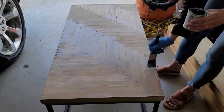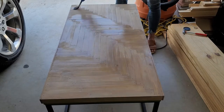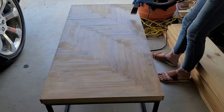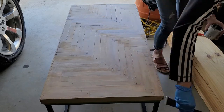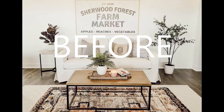With all my staining done, totally dry and ready to go, I clean the surface and then I'm using a matte polyurethane to seal it. This is a coffee table so it'll get harder use. I like how the polyurethane is shiny so I can really see where I've hit all the spots and where I haven't — and it will be great for keeping it durable and kid-friendly.